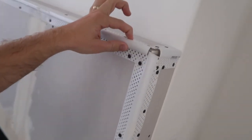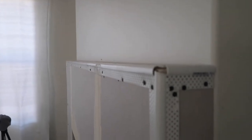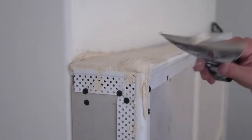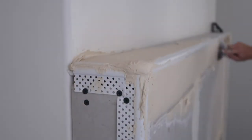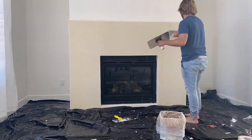I'm going to put mud in these cracks to create that perfectly flushed line with the wall, then mud all of this, get all the screws hidden underneath the mud, and after that it will be time to let it dry and get the coat on everything here to give it the texture we're looking for — then it'll be time to paint. As you can see, this was a seam from this wall to here. I filled the little crack with mud and then taped on top. The seams are really nice and it's turning out pretty good up here too.